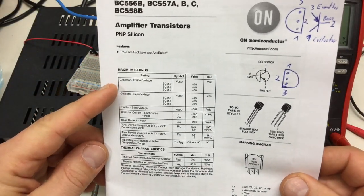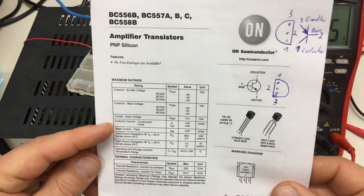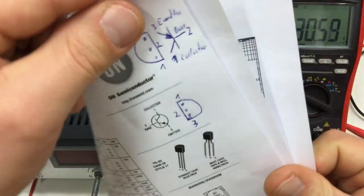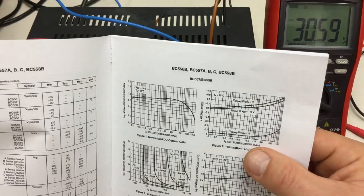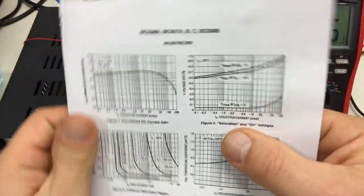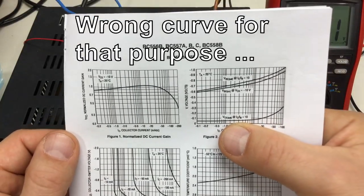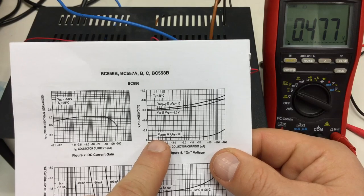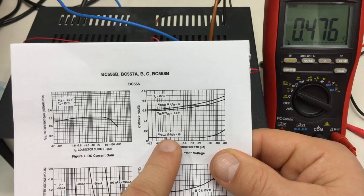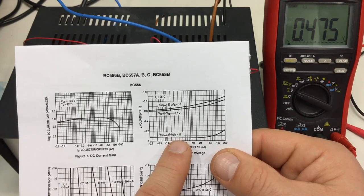Quick look into the data sheet. Let's see, collector current, base emitter voltage, I'm using saturation and on voltages. So, that curve here, what saturation voltage we could. I noticed I read the diagram not correctly. This is for collector emitter saturation at collector over base being 10, but we are driving 20 milliamps